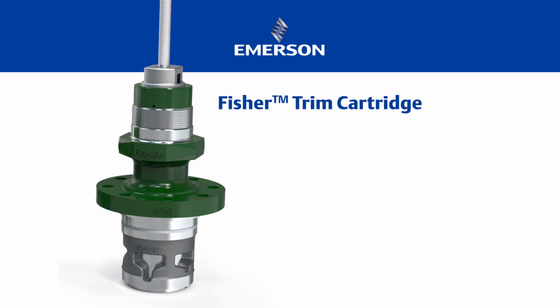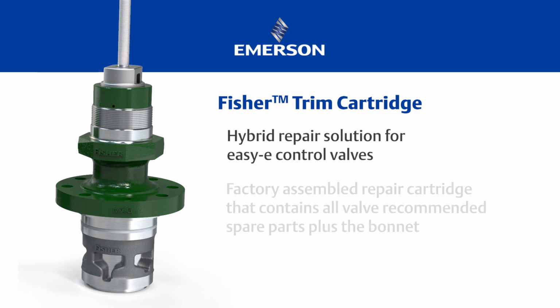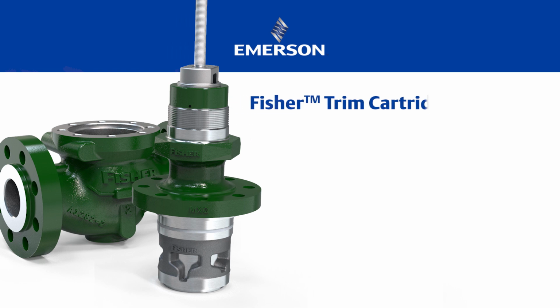Fisher Trim Cartridge is a new-to-market hybrid repair solution for Easy-E control valves that brings confidence to their repair. It is a factory-assembled repair cartridge that contains all valve-recommended spare parts, plus the bonnet in a single, serialized part number, and is offered as both a repair part and as an option available in new Easy-E assemblies.